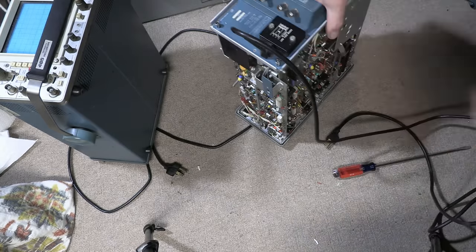The last thing I want to try doing is adjusting the probe compensation. There's a little hole in the side of these probes — you can put a small screwdriver, ideally plastic, and adjust it to flatten out the waveform. It's curious — channel 2 curves one way and channel 1 curves the other way. Channel 1 is now using a cheapo generic probe, and channel 2 is the expensive Hewlett Packard 400 MHz probe. I'm going to find a little tool that fits in there and make the adjustment. Just that simple.